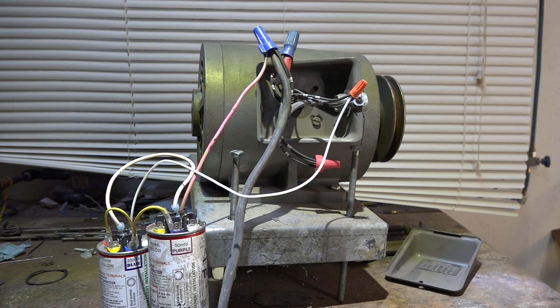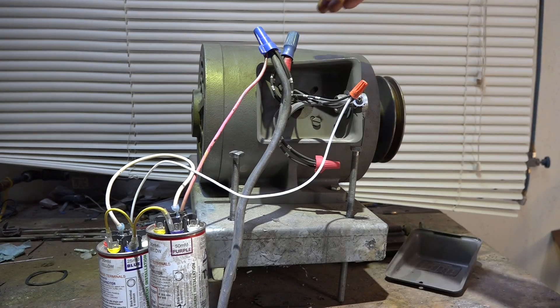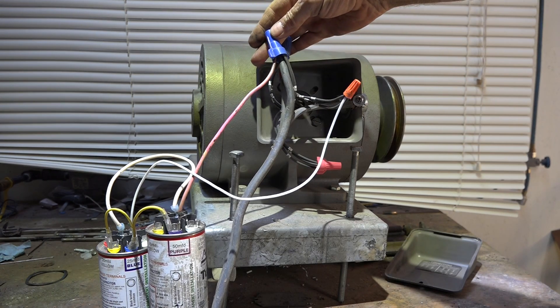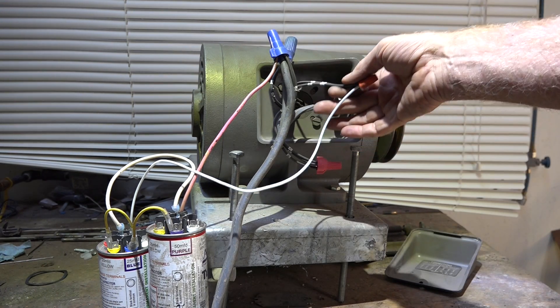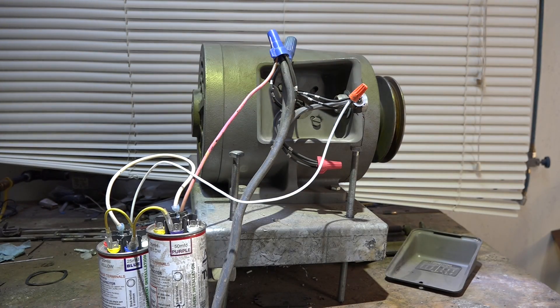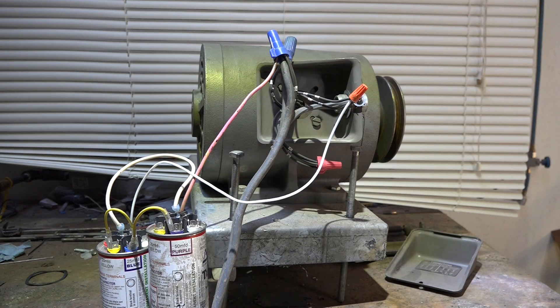To give an idea of how I set this up — I know it kind of looks like a nightmare here, and this is not permanent, this is just a testing circuit. I have my power coming in here and it goes to two of the lines of the three-phase unit. The third phase is right here and it goes to the common of these two caps and I've got about 75 microfarad there. One side hooks into one of the taps here and one to there.